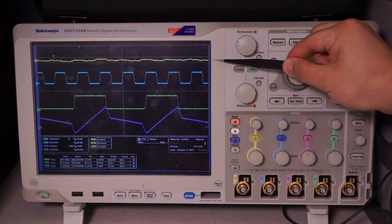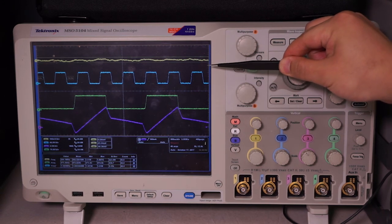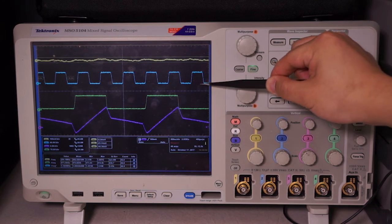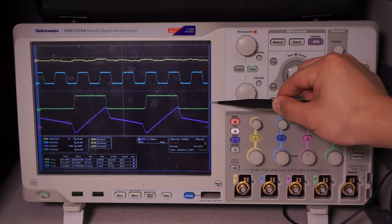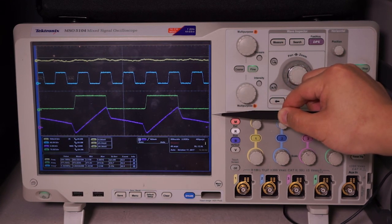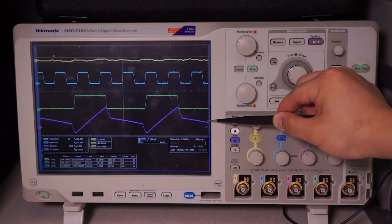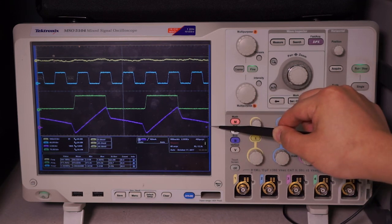This is the waveform for both stages. The first waveform is the output voltage with small voltage ripple. The second is the drain-source voltage of the LLC primary devices — we can see ZVS operation. The last two are the drain-source voltage of the buck converter and the inductor current. We can see CrM operation for the inductor current, and this negative current is used to achieve ZVS operation.